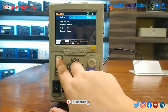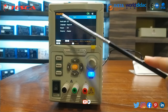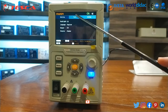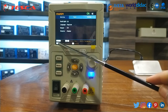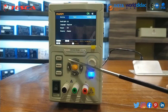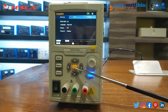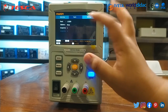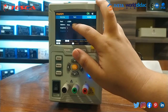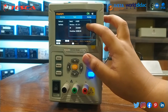When you press the system key, you go to the system setup screen. You can set the utility port and system parameters here. To exit, click the system key again; use the direction keys to navigate and the OK button to confirm. For port selection, you can configure baud rate, odd/even parity, and stop bits — this is the system configuration.